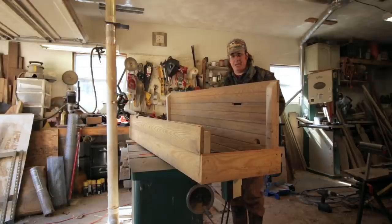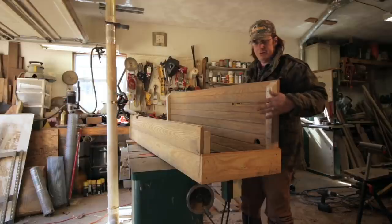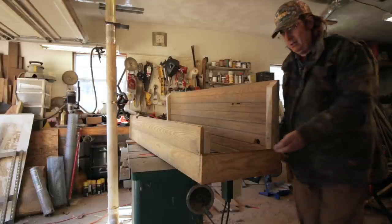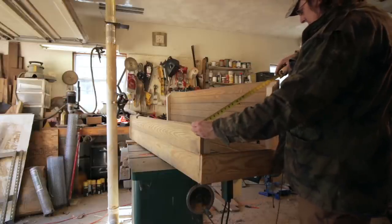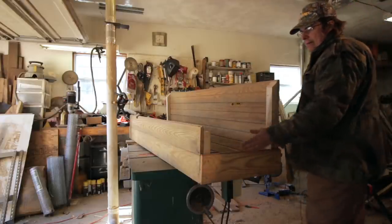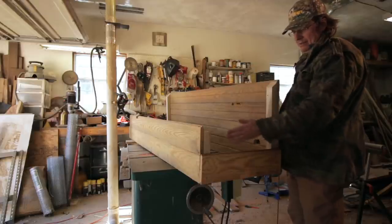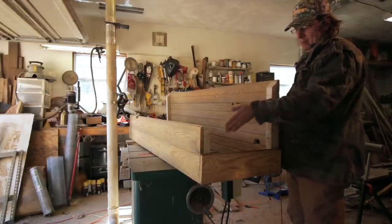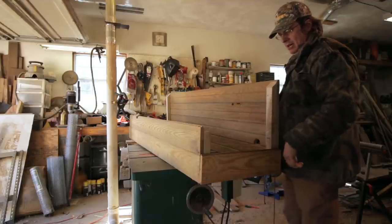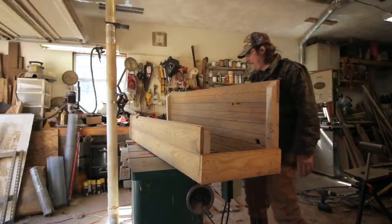She's coming together pretty good. I've got the 20-inch sides on and I'm doing the first row just to double-check everything. These sides are indeed 20 inches, making that angle 22.75 inches exactly. Now I can finish laying up the sides. I'll need to put another little support on the inside since the boards as they come up won't reach all the way over to tie into the existing support, so I'll just connect those together.